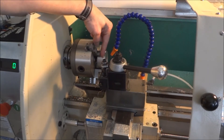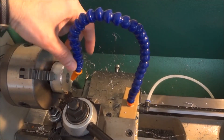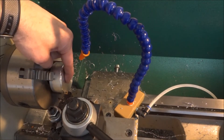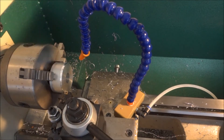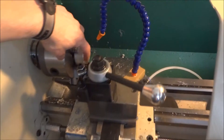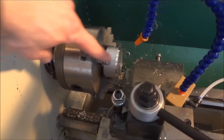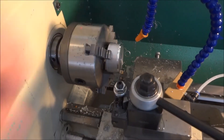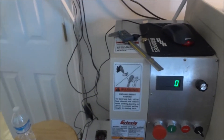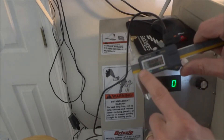First we're going to face it, then do the profile, and then do the internal profile. I went ahead on my manual lathe and took some of the center out, because I haven't done a lot of close-tolerance internal boring and I'm still learning that. I wanted to make sure I had clearance. I've set my Z to the edge of my stock, turned a small portion, and now I'm fixing to set my X. I thought I'd just show you how that works with eye gauging.